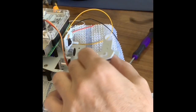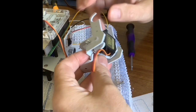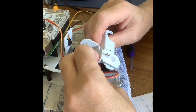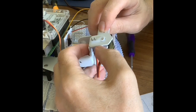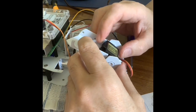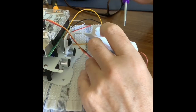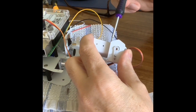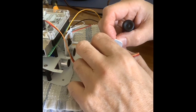At this point Paul ran into a problem. They're asking you to hold this at 90 degrees, but the servo black box is not fixed to this yet. So whilst you're holding that at 90 degrees, you've got to put the servo in so that these holes line up — but it's very difficult because everything's so sloppy. It might help if the black servo box was fixed to this component first, then zeroed, making it easy to get it at 90 degrees. But that means the rivet assembly is put in afterwards.